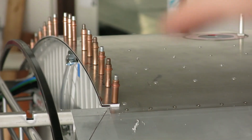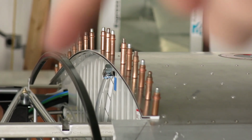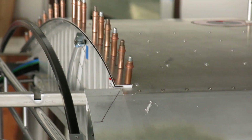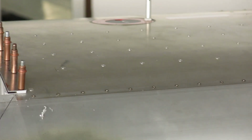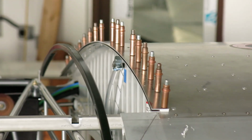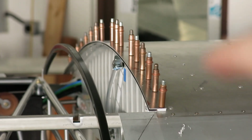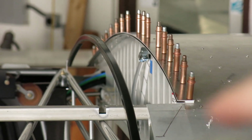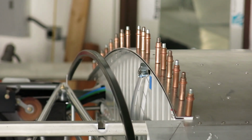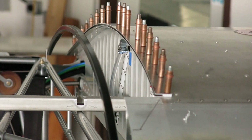Note on that top spacer strip, that's the one that you do first. You measure out and you mark and drill all the holes in it first, so that's what you use to transfer drill through. That gets cut to 46 and 7/8. And don't worry if you lay that down on the skin and you line it up in the front and it's a little bit long in the back, because it's actually on the top side. So once you put that all together, it's perfect on the back. I'll show that here.